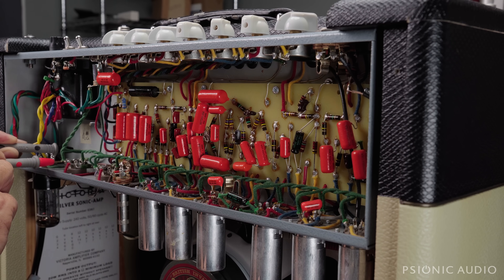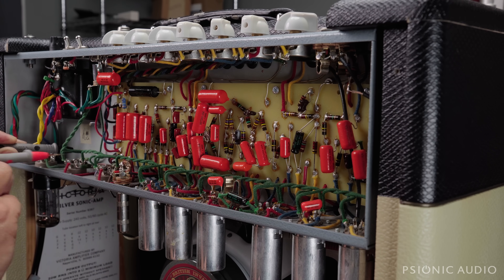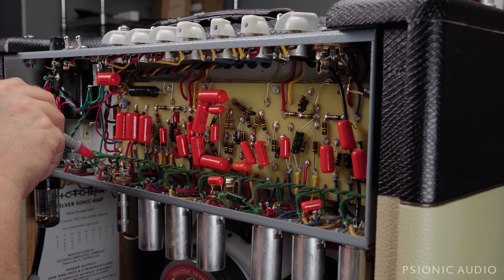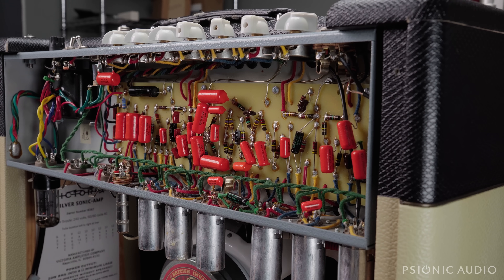The plate is 365.5 volts — 365.5 on both. Screen is 363.4. But on the other side: 300 volts. That's our problem. There's your trouble.